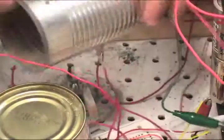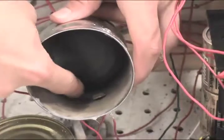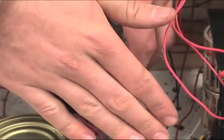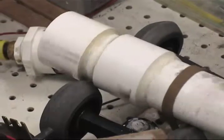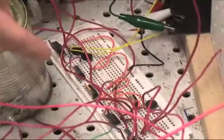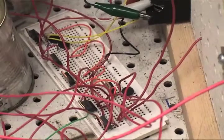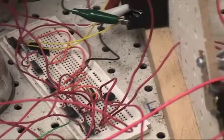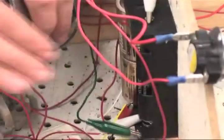Transistors are tripped with 3 volts from this power source here, so there's 3 volts going through this CAD cell. When no light is permitted to enter, the transistor is in its off, unsaturated state. When light is permitted, the resistance of the CAD cell drops, 3 volts is allowed through the emitter-base junction, the emitter-collector junction opens, it goes into saturation, and it's allowed to run the next step. These are power transistors — they can handle 12 volts and are sensitive enough to use 3 volts at the emitter-base junction.